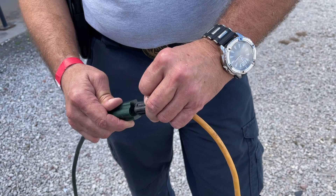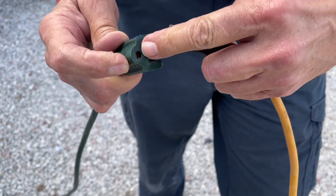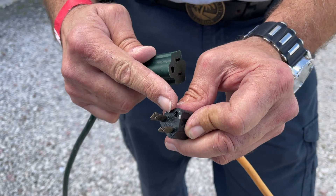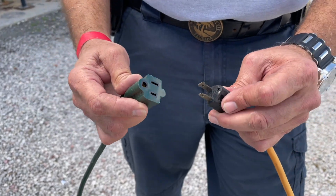As you can see, when we plug it in — no ground. Which part is the ground? Can you point to that area? That's your ground right here. So that's supposed to have a ground plug. So what happens when you don't? Your ground is your safety net, and without a ground, you do not have a safety net.